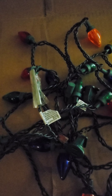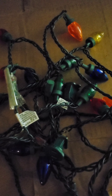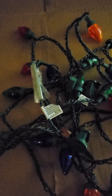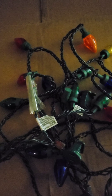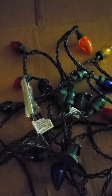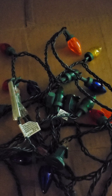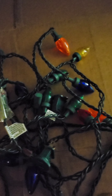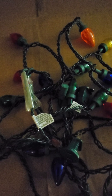I still prefer incandescents because even though the technology is getting better, it's still too harsh in western New York winters. That capacitor right there is our culprit. This is the last of the set from 2014 from Walmart — that tells you how great Walmart quality is, especially when we had two sets replaced immediately. I had some from 2013 but long story short, these died before I even had them on a bush. Tried them again — did not work either, so we can call this dead.